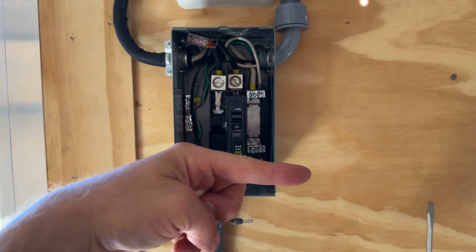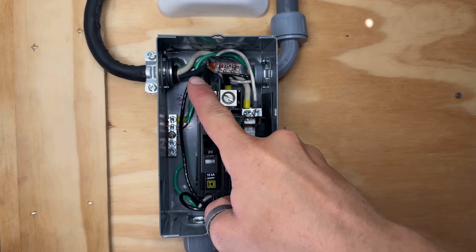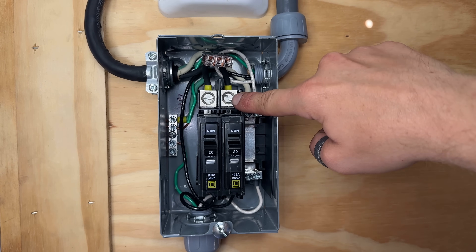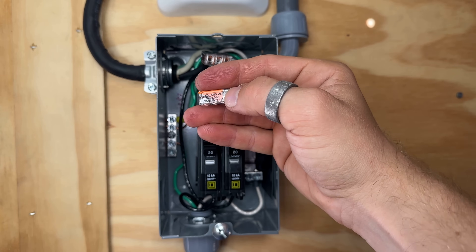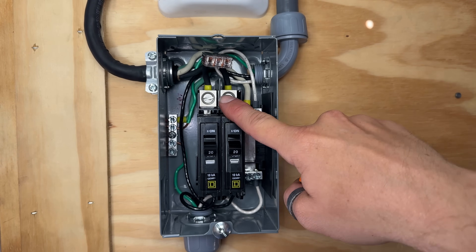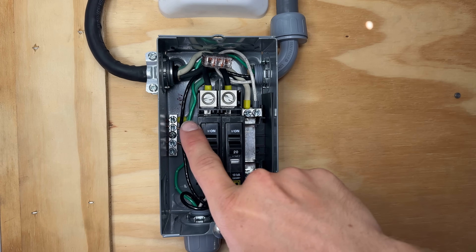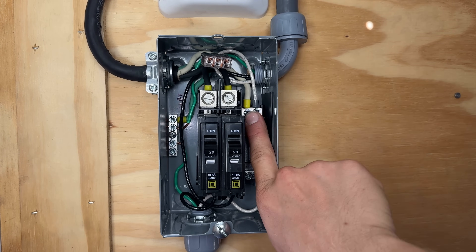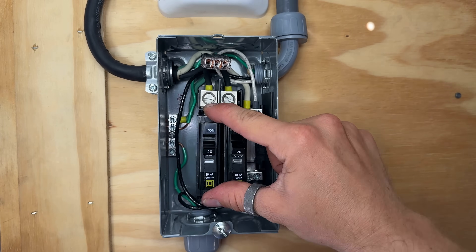This one will be to the outlet in the back and this one will be to the outlet down below. It looks a bit of a mess, but you've got your 30 amp three-wire 10-gauge cable coming through, and the hot — the black here — I took and put in the middle of this WAGO jumper and then each jumper down to each of these terminals here. Before you freak out, these WAGOs are indeed rated for 450 volts, 41 amps if you're using 10-gauge wire — really nice little WAGOs, love these things. They go into the breakers, and each breaker has one hot coming out going up and over to the outlet on the back of the trailer, and then this one here goes down to the outlet on the bottom. Ground wire in there to the ground terminal. Each outlet has its own ground and then all the neutrals tie into this bus bar here — bottom outlet here, back outlet here, and then the main three-wire cable coming in.